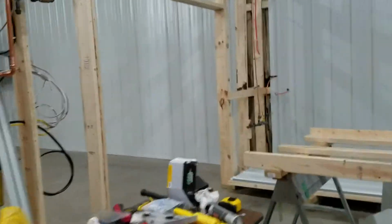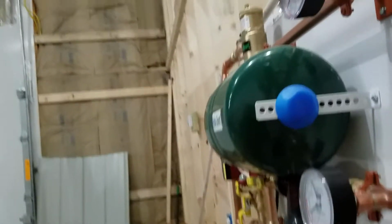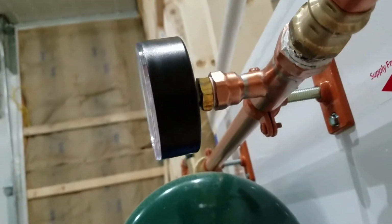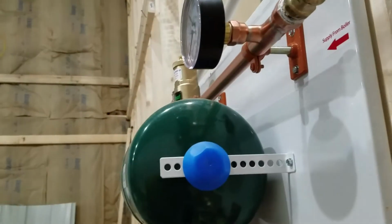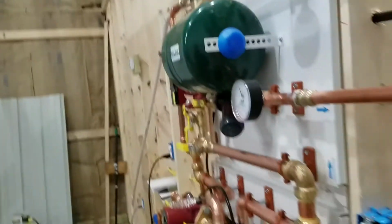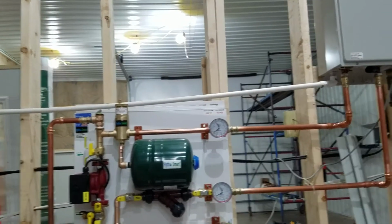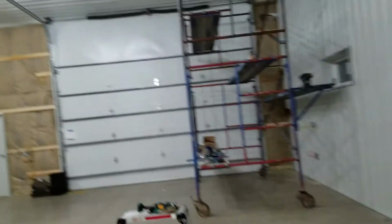So yeah, that's working. I'm hoping I finally have this drip from these gauges solved. I keep tightening them. Let's see. No, that thing's still dripping. That one is too. I'm going to wind up depressurizing this system and retaping these gauges, I think. But it's not going to be today. It's not losing enough fluid for me to get to that point. It hasn't even lost any pressure. It's still holding pressure, but I bet we've lost probably 5-6 tablespoons in the last 2 weeks, so it is something I have to address.